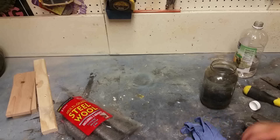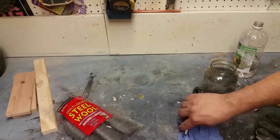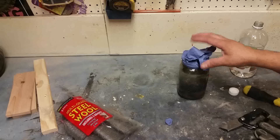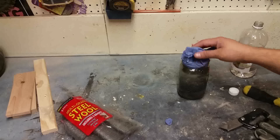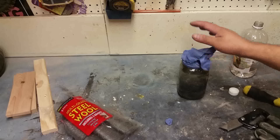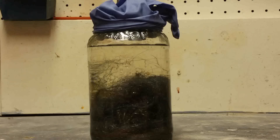As far as the lid goes, like I said, you don't want to use a lid. What I've got here is just a latex glove. The cuts that I made in the glove are going to allow the gases to expand and escape out of the jar. If you were to cover it and put a lid on it, the gases have nowhere to go. At this point you probably want to take this stuff outside — it really stinks. The vinegar is actually breaking down that steel wool and you can see the gases coming up right to the top.